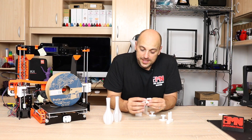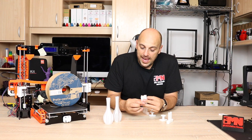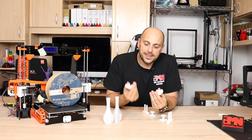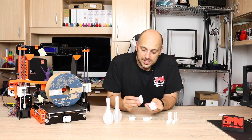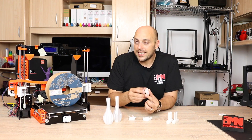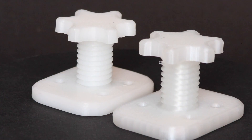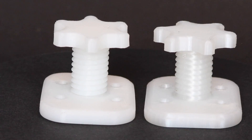As you can see, the parts are now opaque — they're not translucent anymore — and that means the annealing process is complete. When I squeeze the two together I can feel that the unannealed ones are about to give up, whereas the annealed ones are much stronger. In terms of tolerances, this one is still not cooked and this one is cooked, and the tolerances have not changed at all — it still turns as freely as it did before, so I was extremely happy with that.